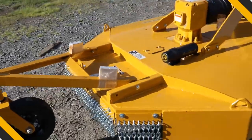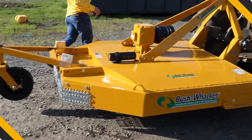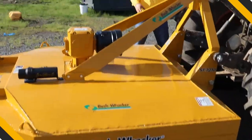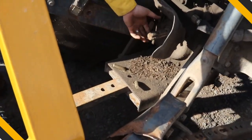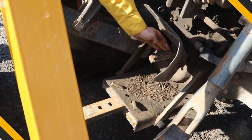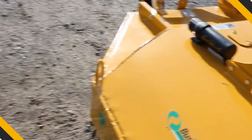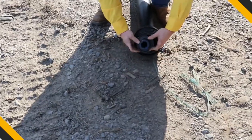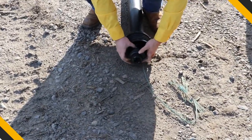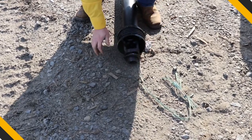Once you've got all that set, you want to come over to your driveline. On the front of that driveline, it has a ball collar kit, which I'll show you in a second. There are grooves on your PTO shaft — those ball bearings need to sit in this groove. If you go too far, just pull it back and you'll hear it lock into place. Here are the ball bearings, or the ball collar kit as we call it. You can see once you pull this collar back, it exposes those, and that's what locks into that groove on the PTO.